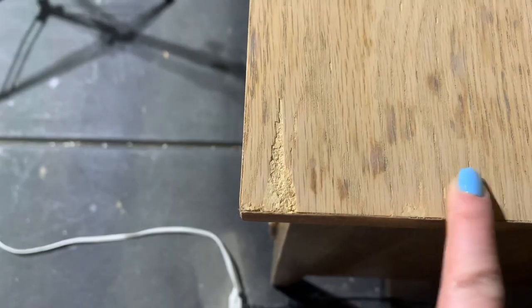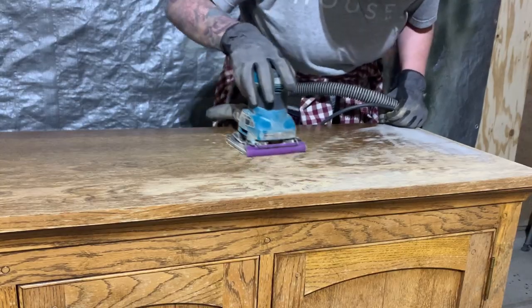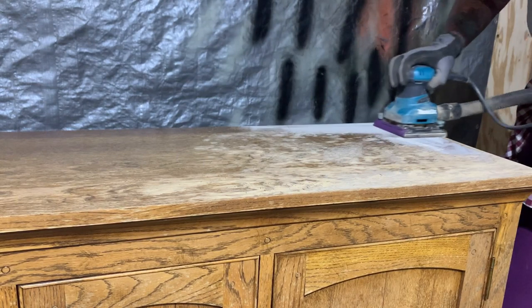I'm so pleasantly surprised. There are spots where I need to pull up the veneer and patch, but I see no need to pull everything up and no swelling. So I set to work sanding down the rest of the top with 150 grit sandpaper to remove all of the failing finish and to smooth out the places where the moisture raised the texture.